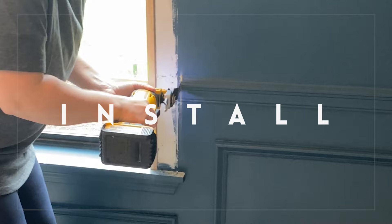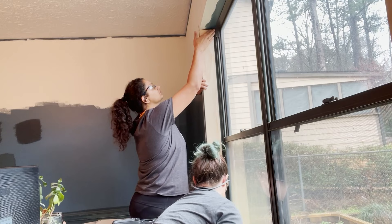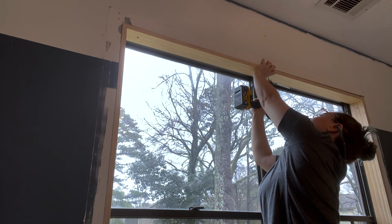Before I could place the final assembly in the window, I used a multi-tool to cut back some of the chair rail. I like to remove small pieces at a time and go back and cut away more if needed rather than trying to get the measurement exact on the first try. It's always easier to cut away more than to try and add back if you cut away too much. During the installation, I tried to be mindful of exactly where the shelves would be and exactly where the rest of the assembled shelf supports would be in order to hide some of these screws as I install.